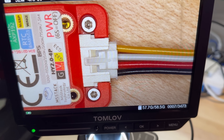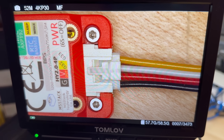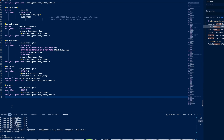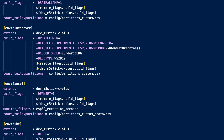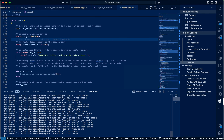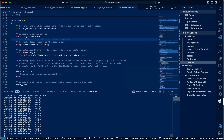There's a small 4-pin Grove connector on the module, and we'll need just two of its wires. We'll leave the power completely unconnected, as we'll be powering the strip directly with its own 5V. But the ground has to be connected, and we need to connect our data line — so with just ground and data connected, we should have full control over the LED strip. I'm using PlatformIO to build this code, so in my source control file I've defined the constants needed to enable the experimental RGBW support and added a new section for the plate cover project. We set the target to plate cover, select PlatformIO Build, and then Upload to send the program to the ESP32. That takes about 30 seconds, and when done the chip reboots and starts running.